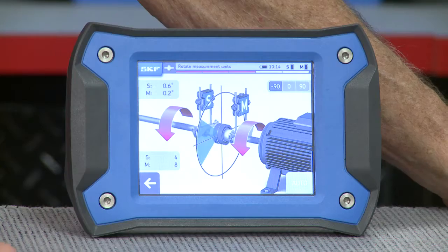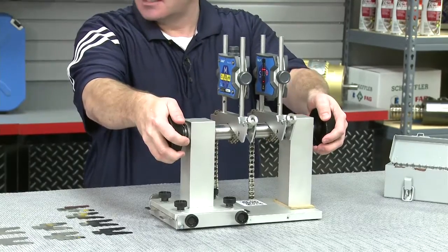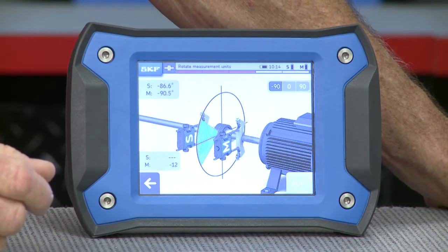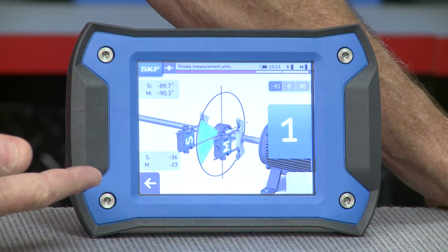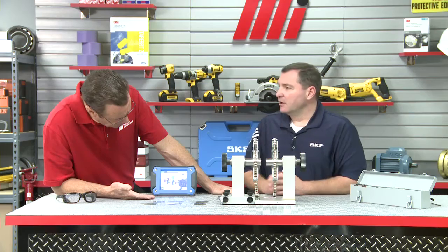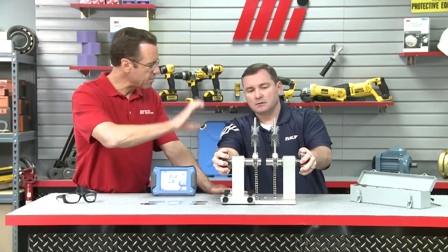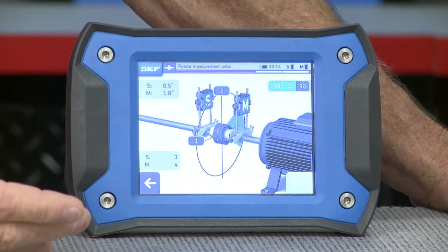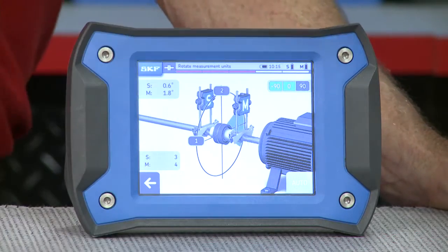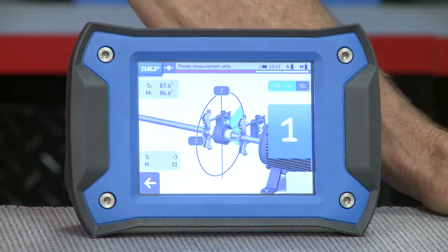Now I've got what looks like a clock with some red arrows. When you do an alignment, you want to be behind the movable machine to know where 9 o'clock is. So we're going to turn the laser heads to the 9 o'clock position. That blue triangle is going to turn green and automatically count down and take a measurement — 3, 2, 1. It says okay. Moving on, it tells us to go to 12 o'clock. So are we going to move around the clock just to take measurements on the shaft? Correct. This is pretty simple — I've got green, now we go to 3 o'clock. There are our measurements.